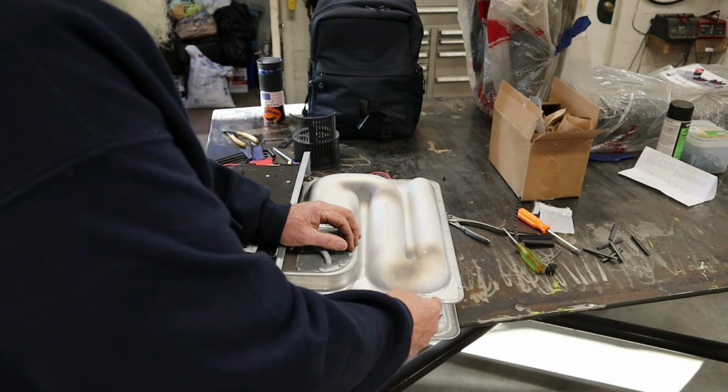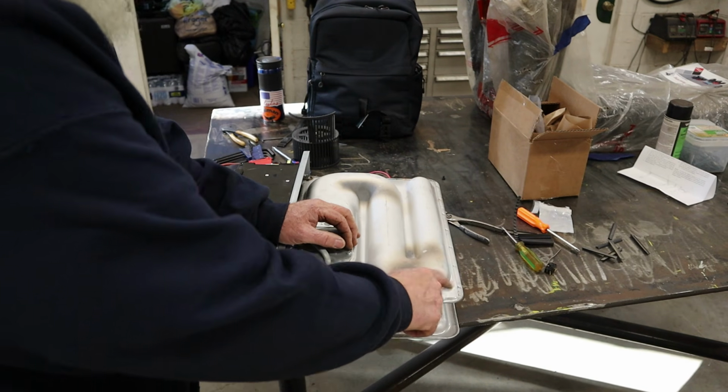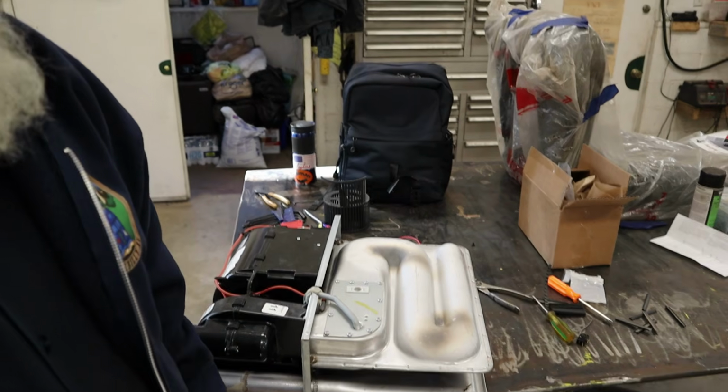Back in the day, we'd see these furnaces that were 20 years old, and we'd see cracks in the firebox, but they'd be ancient when they happened. Of course, they all used to be welded too. Now they're just crimped. They used to be welded on these seams. Now they just crimp them over. But yeah, I have heard that some of these modern furnaces, I don't know whether it's Dometic or Suburban, are having issues with firebox cracking on fairly new furnaces. So be sure and look at that really good. All right. Y'all grab your jackets, your gloves, your hats. Let's head outside and throw this thing on the back of the van and test it. Give her one more spin of the fan, and we'll go test her.